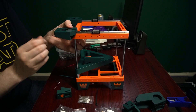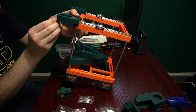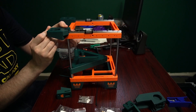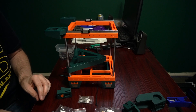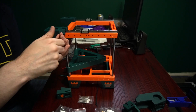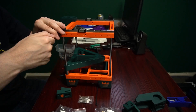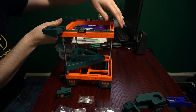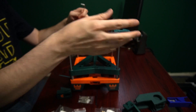For the MK 1.1 parts I've made these motor mounts the same height. So as I said in the previous video, you can actually home the Y-axis now and both sides of the axes will touch the motor mount, so you get a nice clean surface to home onto, which is really great. MK 1.1 is just a lot of quality of life upgrades essentially. If you've already printed the Rook parts, you don't have to throw everything away and reprint — it's a minor revision just to make sure everything is working well, a polish if you will. Motor mounts same size, bolted on nice and securely.